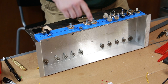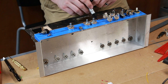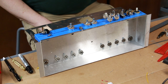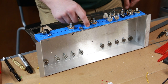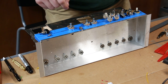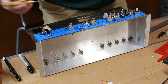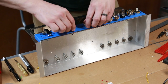I do want to give myself a little gap right here where those wires are coming in — I can make a visual mark because I know that's where the power wires are coming in and this is where the other wires are. My choke drops down through about here; the choke isn't as big a deal because it's just filtering to the power section. Ultimately I'm a bit tight on space on this front panel, but that's where I'm going to try and lay things out. I'll pull out my drill bit guide, set these aside, and go one piece at a time. I'm going to first mark along the center line with my punch awl, then get a small drill bit and drill the pilot hole for all of these, and then line them all up.